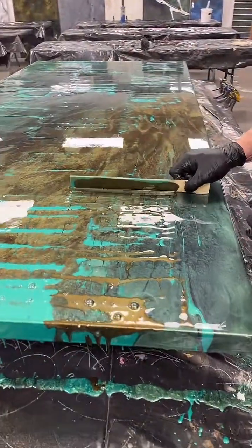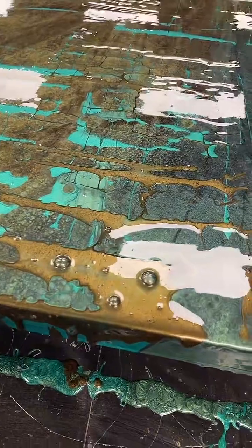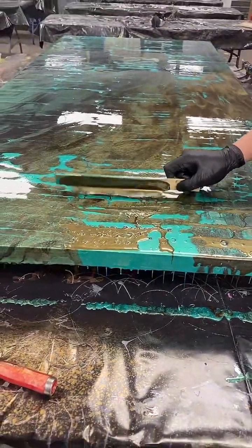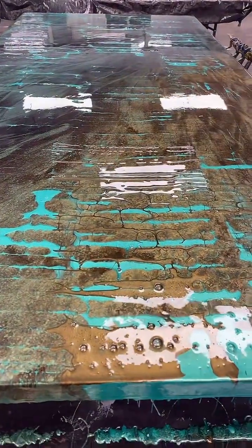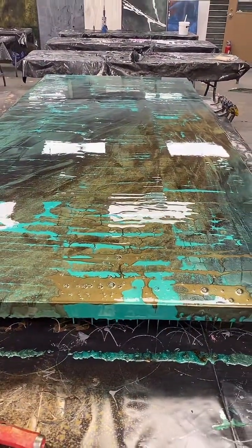This is our bronze, correct? Aged bronze. What's your work time? My work time is about 3 hours if you pour this out at about 75 degrees, and if you pour it out at 105 degrees, you have about 10 minutes. Is that Micro talking? Micro, that is who that was.